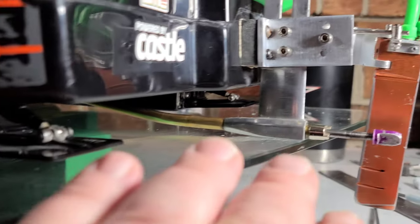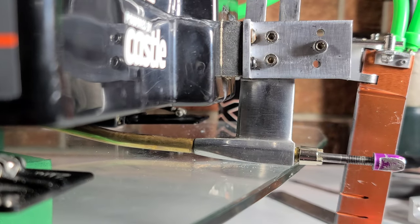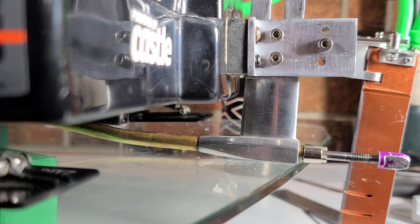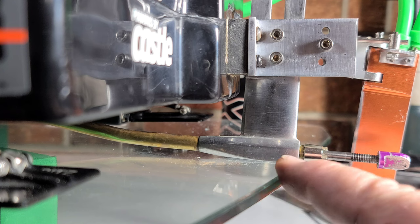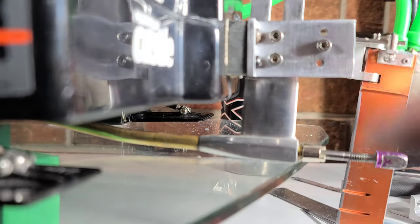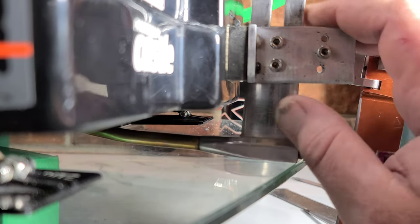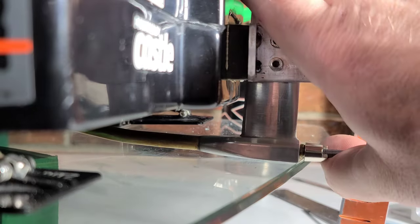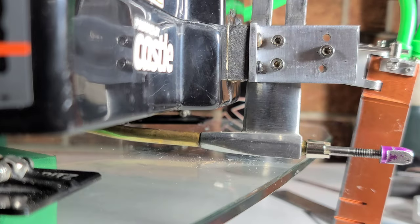This is where I started tuning this boat after the first rebuild. I like this little bit of angle on this boat — it helps. If you run it real deep on this boat it wants to pick up or cause it to veer real bad. So I'll incrementally drop the strut down until I get the best ride. Since I know this boat well — I've had it a year and done a lot of tuning — I know roughly where to start.